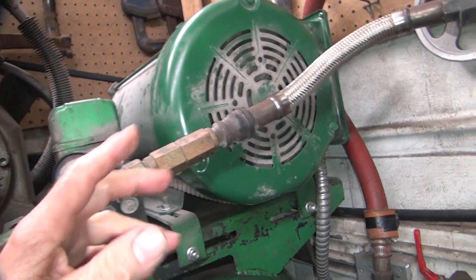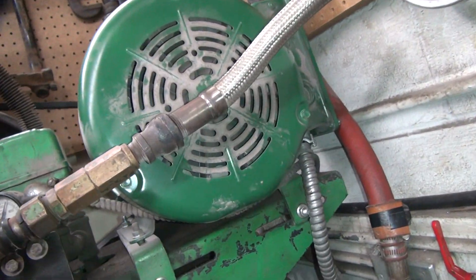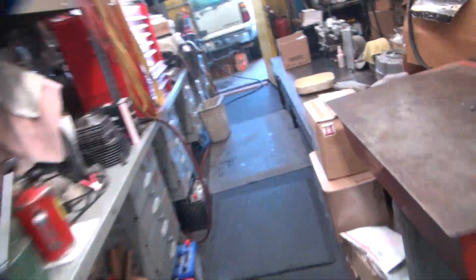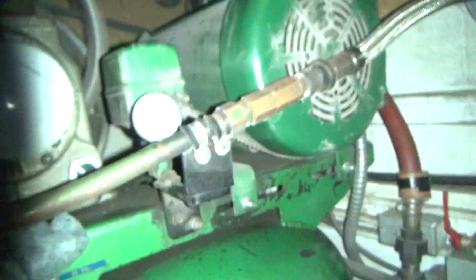You hear that big snap after it started? That's the problem. I can't tell if it's on this side of the motor, that side, or in the middle. There's no sparks that I can see. I'm going to turn the lights off to see if that shows me anything. Okay, lights are off — no sparks. But it definitely sounds like a zapping noise, so it's an arc.